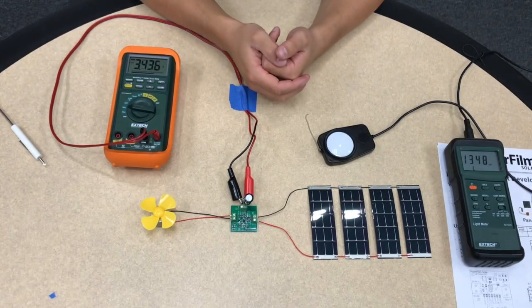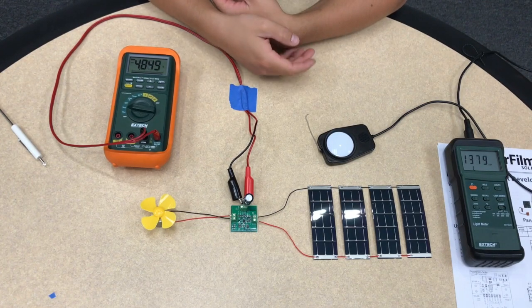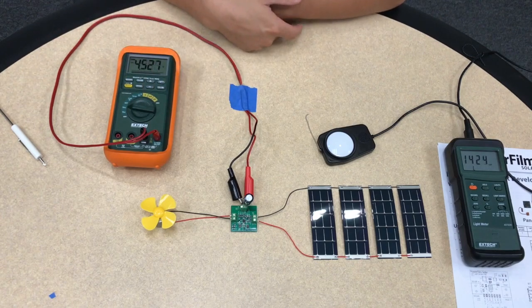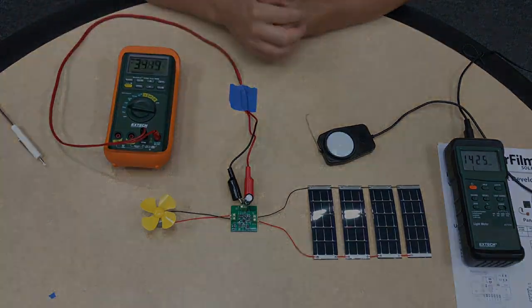As you can see, once the capacitor is charged up to about five volts, the fan will turn on. The capacitor will be discharged and then it will charge back up to five volts and turn the fan back on. This kind of pulsing application, where the load is only connected for a small portion of time, can be used to power some of the higher power applications.